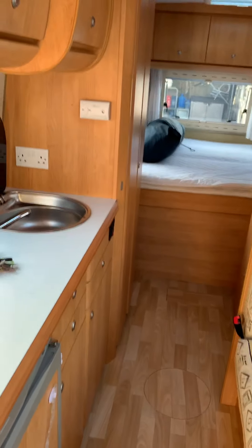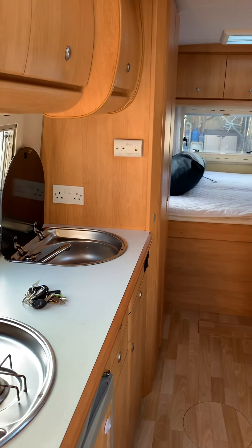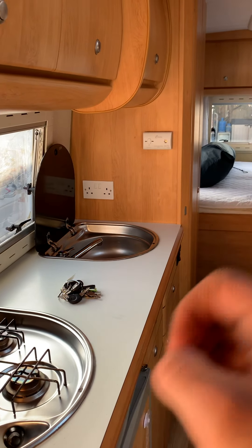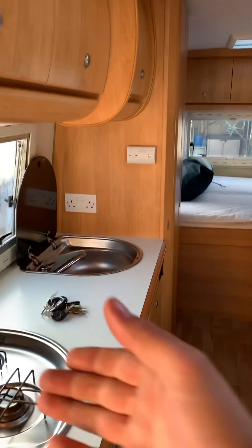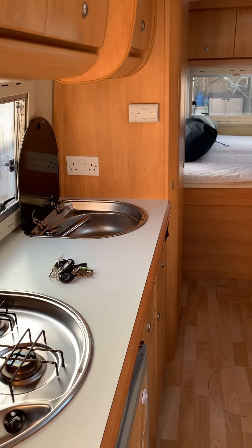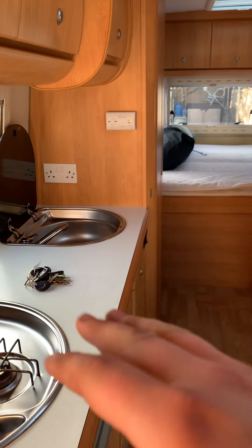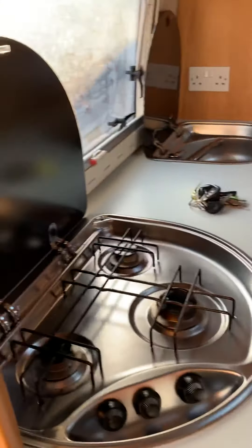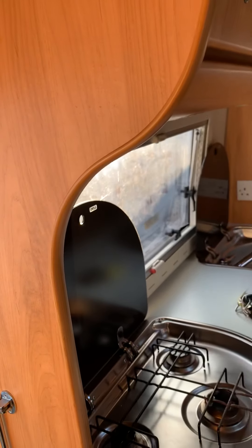The main reason for purging the air, obviously, is to keep your boiler safe. But also if you try to use your hot water and there's air in the system, when you go to pull the hot water through the tap it will cough and splatter all over the place — and it's really not nice when that boiling hot water hits your hand. So just make sure you do that.